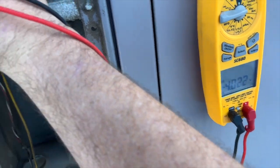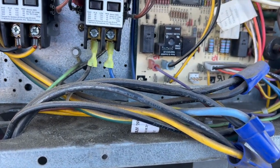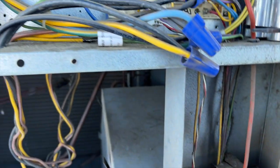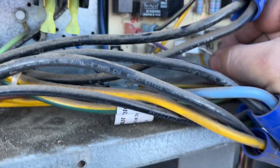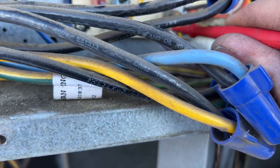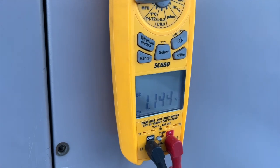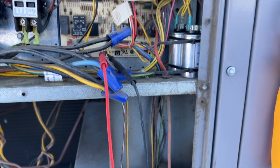I'm on a different unit - it's running. We have our meter set to DC and it's going all over the place, so we know it's working properly. To verify without power first: check the two outside prongs and we're getting 10.6 volts - good. Plug it back in, stick our probes between the white and the black, spin it, and you can see it's fluctuating all over the place. That's how you can tell - that's how you test for it.